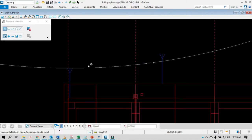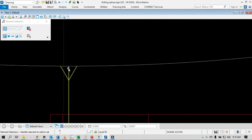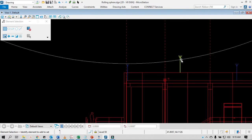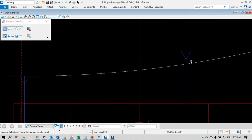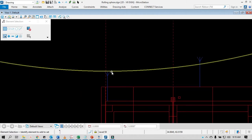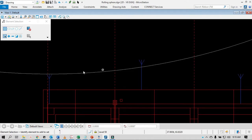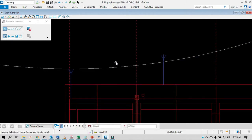Basically, the sphere rolls from the top of one air terminal to the adjacent air terminal. Here you can see, since I put the bottom quadrant of the circle here, it's overlapping onto the next air terminal. So what we want to do is roll back the circle.